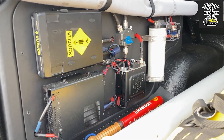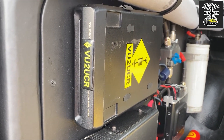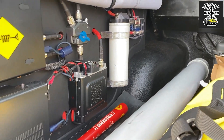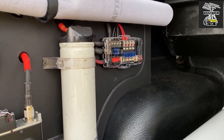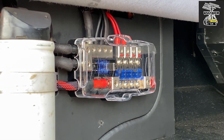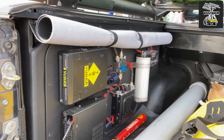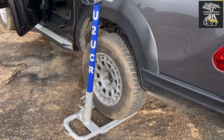At the back I have the FC-50 tuner also connected to the FT-891 radio and the FTM 200 DR radio panel. I also have a 1.5 farad super capacitor and a distribution block with extensive grounding of my car ground to the radios. I also have an antenna switch to switch between different HF antennas, and here on a car stand you can see a connected portable Yagi.